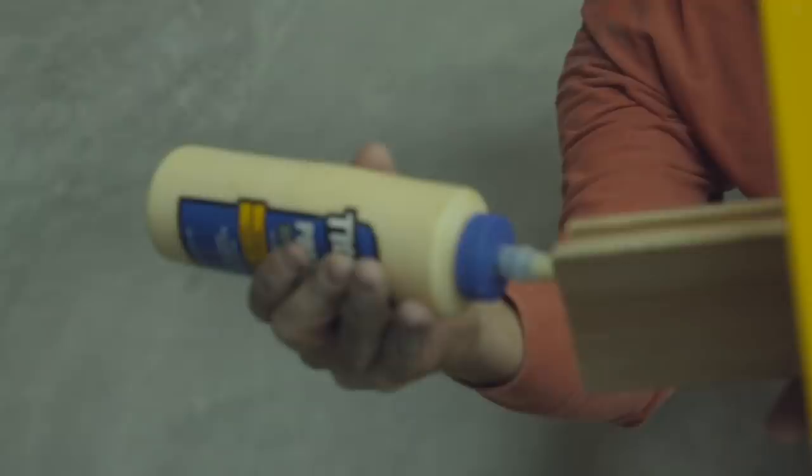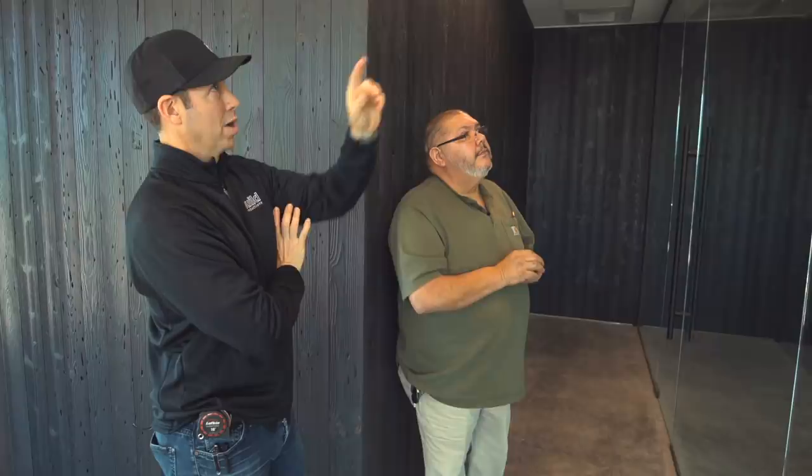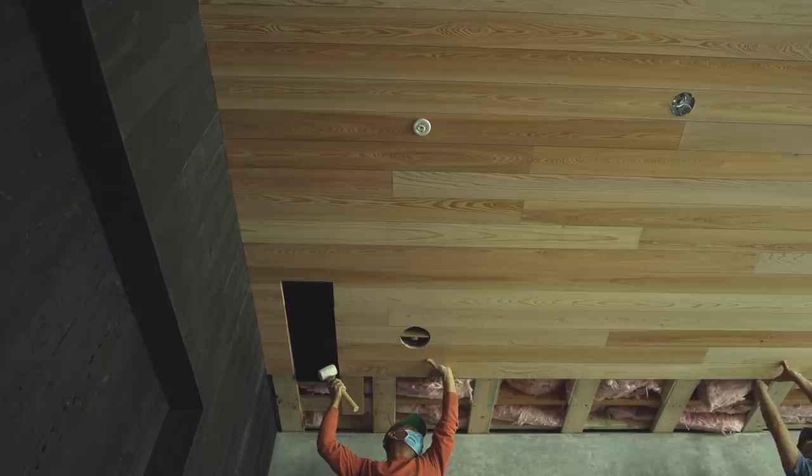These boards came sealed on all sides, but you've got to seal the cuts. We seal the end cuts with glue — if you put sealer on it first, the glue has trouble bonding. The guys spread the glue continuously across that joint with their finger so it's fully covered, which not only seals it but makes sure it doesn't open up and holds it tight. Another minor tip: notice how the HVAC boots are all painted black before the grills get installed. A cheap can of spray paint makes that opening look like a black hole. If those aren't already done on your jobs, do it before the grills and registers go on.